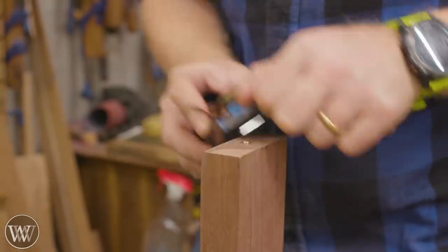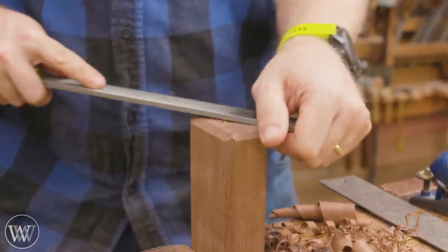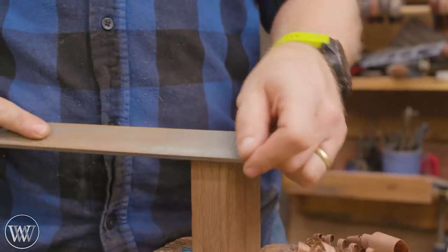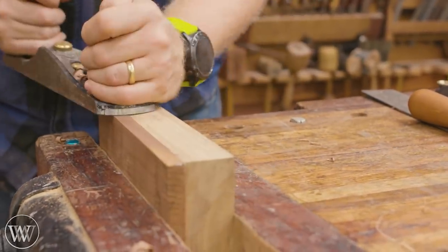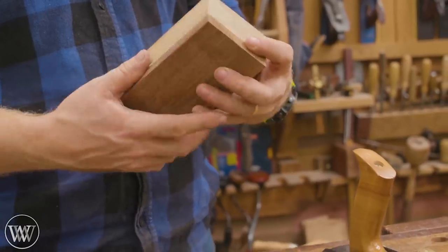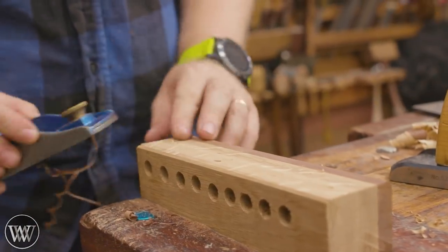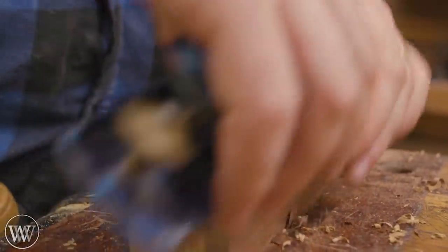Something like that. We can put chamfers all the way around this thing and then we are ready to start doing some detailing. The brass inserts were sticking up just a little bit, so I used a file and used that as the chance to smooth off the end grain as well. There's very little as amazing as an end grain that has been cleaned up with a good file. Now that this is all detailed, we're going to move back onto the bottom because that was still on clamps. We want to take it apart and plane it up. I left the walnut a little bit larger so that I have something to work with. Once we plane it back down to rough size, then we have something more to work with. On the end grain as well, planing into the wood as opposed to letting it run off so I don't get any tear out. We're going to chamfer the top edge, the bottom edge, and the corners — and if you're doing the end grain, just make sure you skew the plane so you're actually running the plane off the end grain.